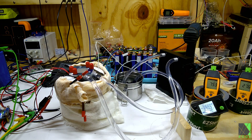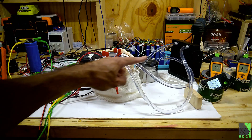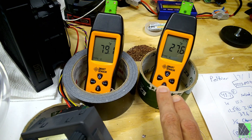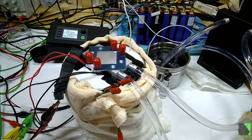The performance of this setup is exceeding my expectations. I want a Peltier freezer that's solid state, runs off solar power, and can freeze my food without using a compressor or any refrigeration technology. It's currently been running for a couple of hours. I'm circulating water over the Peltier element to cool it off, and that goes through a radiator right there to take the heat out of the water properly. Here are the thermometers showing the ambient temperature, the water temperature, and the temperature inside the freezing chamber. The purpose of this video is to show that a Peltier freezer is possible, that solar power can run it — and that's what's powering it now, all solar power. If a bench setup like this can reach freezing temperatures, there's no reason why a product could not be sold on store shelves as an actual freezer and not just a cooler. I wanted to show that it can be done.